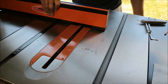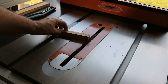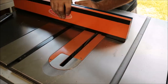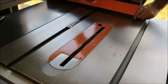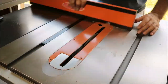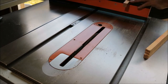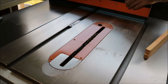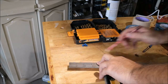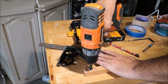Once it fits in the gap and it's deep enough, I'll make a little tiny shim to make sure that it's tight against there the way it needs to be in the groove. I'm just making it a little bit deeper — it wasn't quite deep enough. That would be a personal preference, how deep you wanted that wood to sit inside that groove. Sorry, I did some of that kind of out of the picture there.